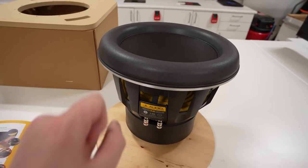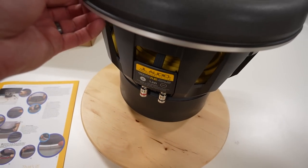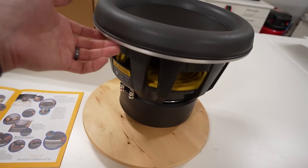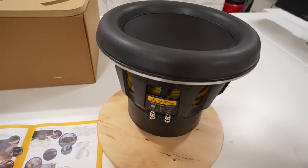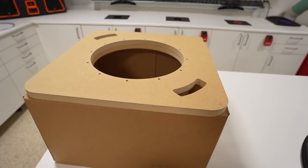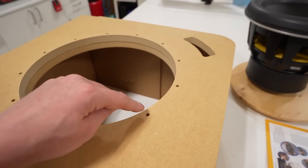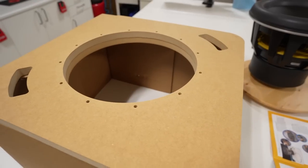Now in order to install the W7, we first want to connect our speaker wires to the wire terminals. It's important to note that if your W7 does have dual voice coils, make sure that both voice coils are attached. If you plan on mounting the W7 on a vertical face, it's definitely a good idea to get an extra set of hands to help you out. As a quick pro tip, you can take the mounting baffle from the shipping carton and use it as a guide to pre-drill each of your mounting hole locations onto your subwoofer box.